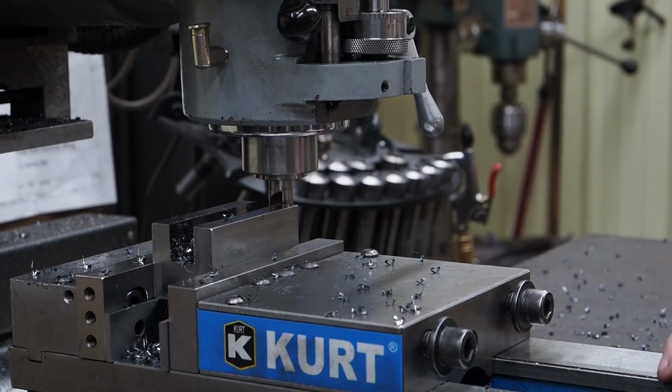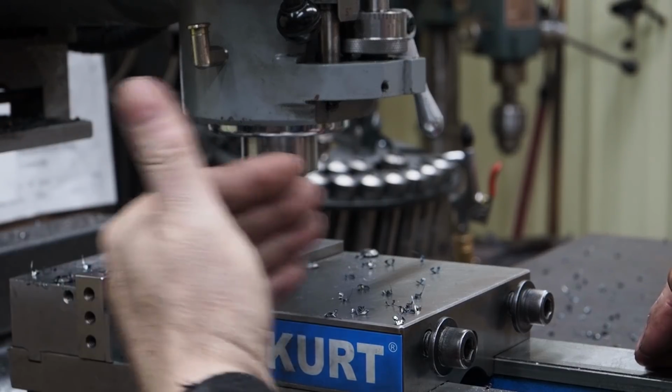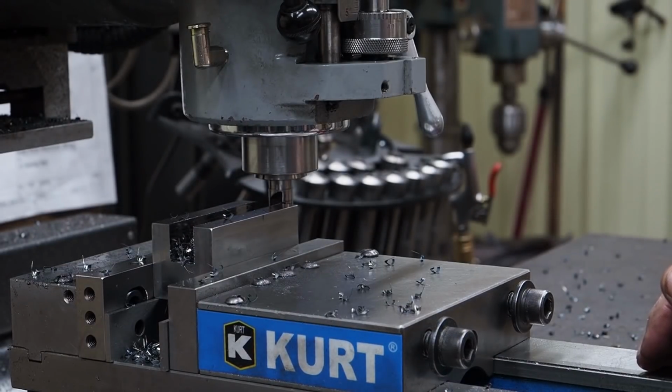And right now we're at 800 thousandths. This side against the wall, if I really wanted to use this cutter to finish it up, I'd have to move 10 thousandths over and come back again. But I'm going to be throwing a finishing mill in from here and cleaning things up, and so that extra little 10 thousandths on the side, I'm not worried about. The finisher will clean it up.